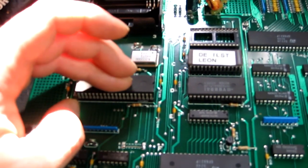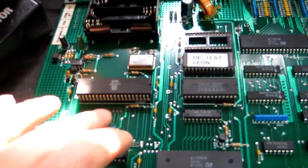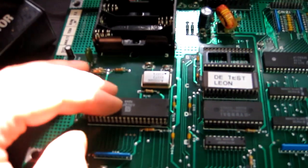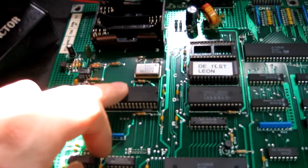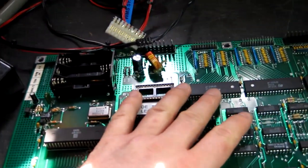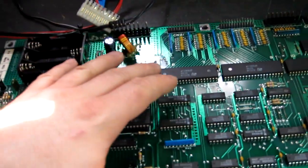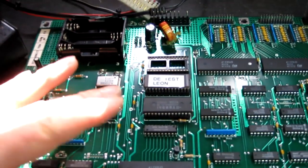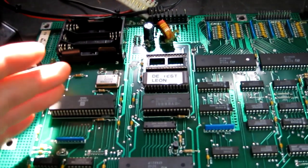With the old socket we were getting a lot of start-stop activity with the CPU and weren't able to reliably test it. Now that we've got nice good contacts with this turned-pin socket, we've been testing again and D7 is stuck low — and it's actually on the CPU side, funnily enough, not the bus side with the PIAs. Normally it's one of the PIAs that shorts internally and then drags down that data line for all PIAs, so I was actually wrong on my guess.